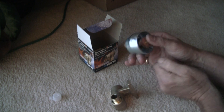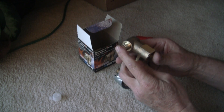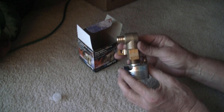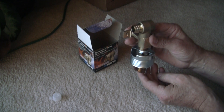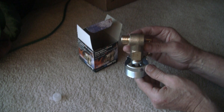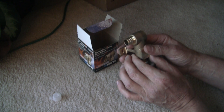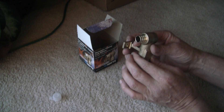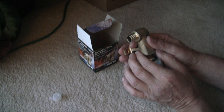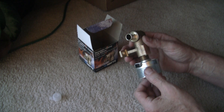So, this is a 474 Viking and this is a Watts fitting — three-quarter inch here for the PEX, this faces down, this is a half inch nipple, and the fire sprinkler itself gets attached facing down. Make sure that you use the proper fittings and the proper PEX. In this case, I'm going to be using RF PEX — that's a Watts brand — and that's for residential fire systems. I'll show you that in a later video.